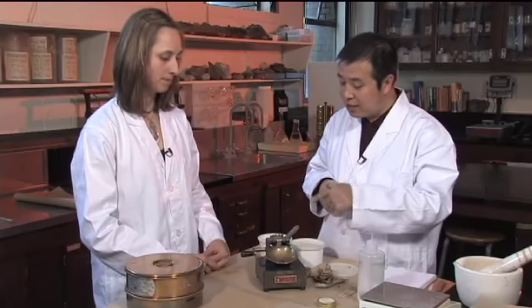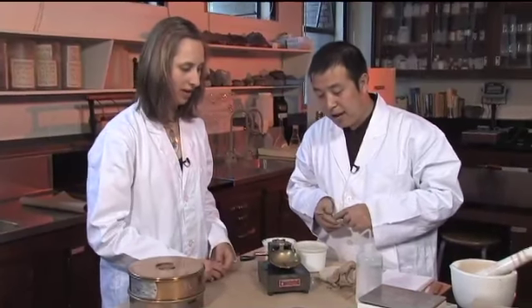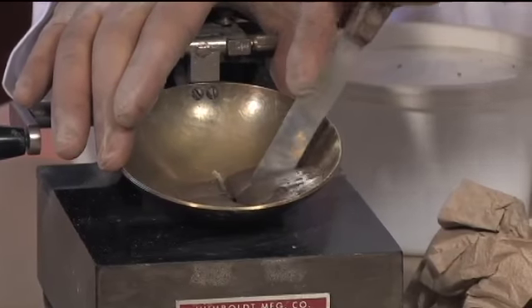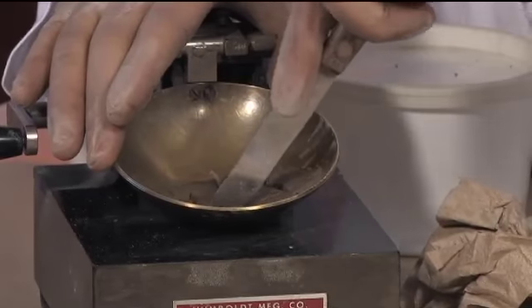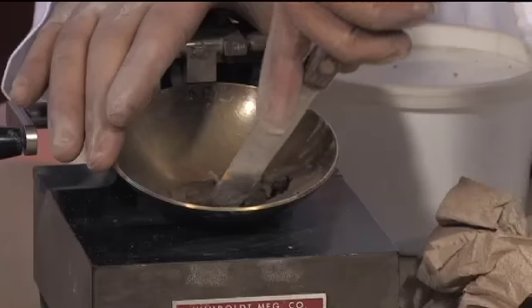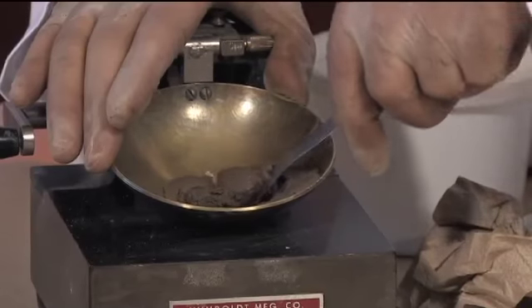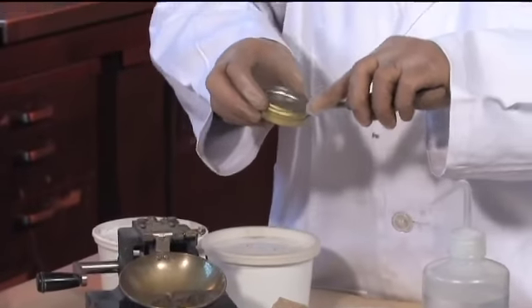So for those strokes — 32 — that's in range. We can use this number and then use the formula to get the liquid limit for this test. That's what this is about: finding the water content where the soil behaves like that. I always do three replicates, so I get one sample from each test. I'm taking that subsample from right where the groove met — exactly, from the middle — as that part reflects how the soil behaved. That goes into the moisture tin.